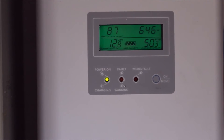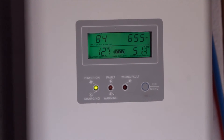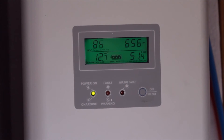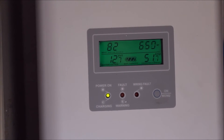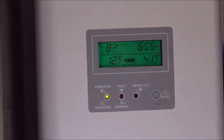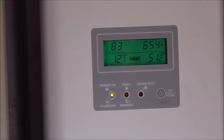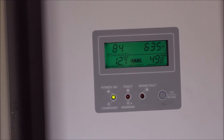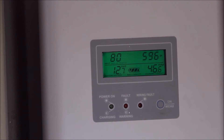My current is about 8 amps at roughly 750 watts input into the controller, and it's a lot easier than running a heavier gauge cable. Instead of having 50 or even 40 amps coming from the panels, at such a low voltage your voltage drop is going to be significant, so your power loss will be significant. This way is more efficient in that regard.